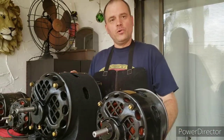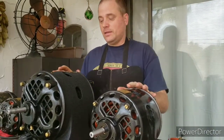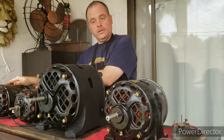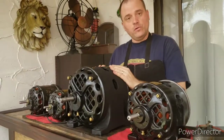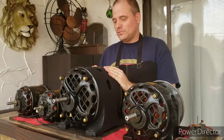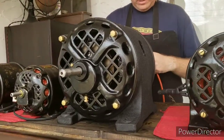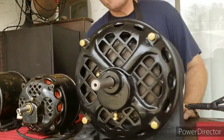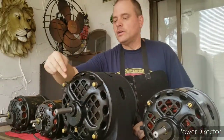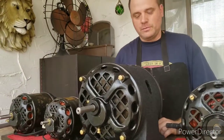And lastly, we have the one horsepower, 1750 RPM motor. These two motors have the patent dates of 1899 and 1903, so they are older than the other two. This motor has a P4 frame. It weighs just under 150 pounds. After about 80 hours worth of work, I'm real happy to be able to share it with you. It runs really nice and smooth. The action on the brushes when they snap back is a real positive action. You can hear the rings rattling around in there — I don't have the baths filled up with oil, I just got these here for demonstration purposes.